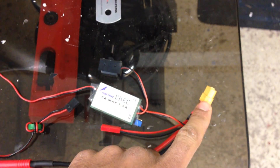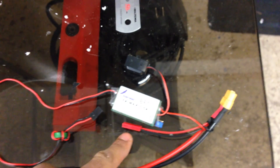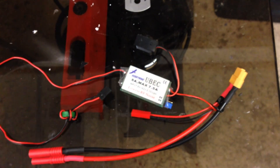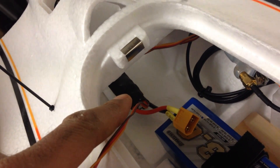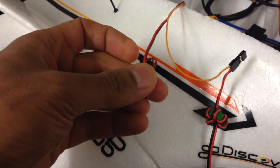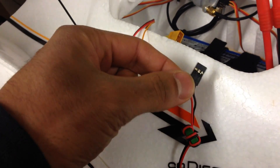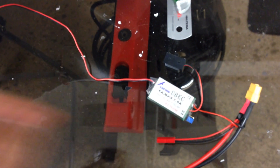You need to make this wiring harness from here to here anyway. If you decide you don't want to use the ESC 5V and you want 12V, then you plug a voltage regulator in here. So I've now made that adjustment — I'm taking the signal wire out of the ESC, tying off the 5V wire with insulation tape, popping the signal wire into a servo connector. That's going to be my throttle, and the 5V will come from the UBEC.